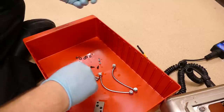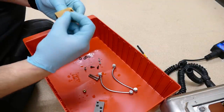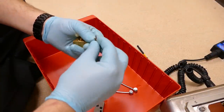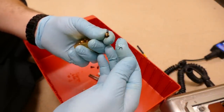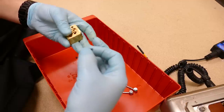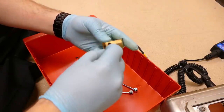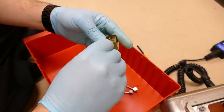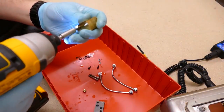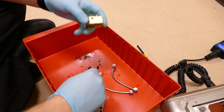Now it's clean, dry, and inspected through all the tiny little holes. We're going to reassemble starting with the tiny stainless steel check valves. First, drop the stainless steel ball down into its hole. You can see some of the debris that was contaminating it right here on this check valve — that tiny little piece of debris is all it takes to block one of these tiny little needle valves. The stainless steel ball is in its hole; I've inspected the cap screw, it's clean — reinsert and tighten it back down. It doesn't have to be very tight — the o-ring keeps its place.